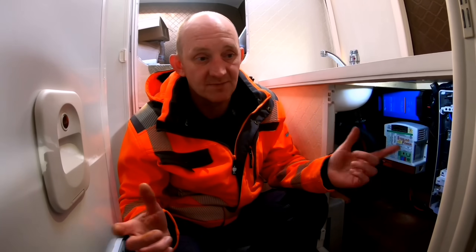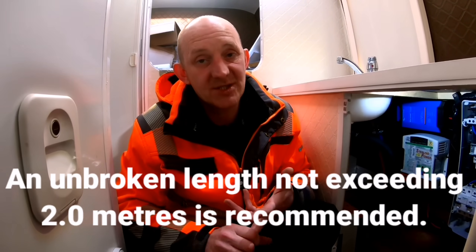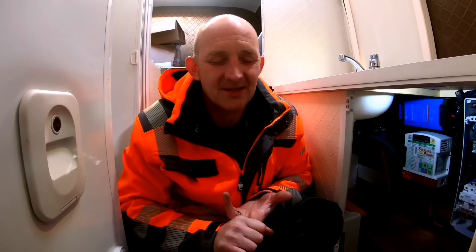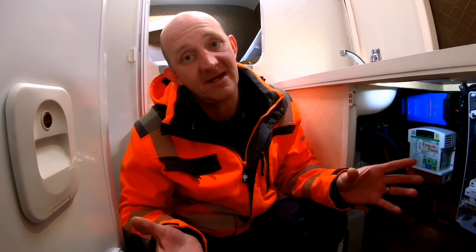Keeping on the hook-up point — a question came in about the length of cable. Rule of thumb: always as short as possible. Generally it's around 1.8 metres. If you go over that, you need to protect it in a conduit and it needs supporting — I believe every 400 millimetres or something like that. We can check in the paperwork for that, but it's around that. Always very well supported and some kind of conduit to protect it.